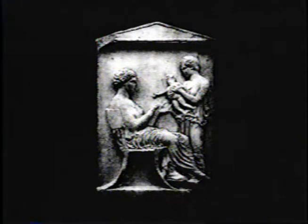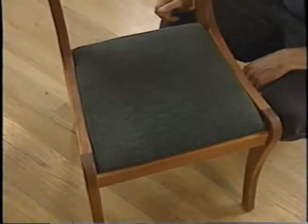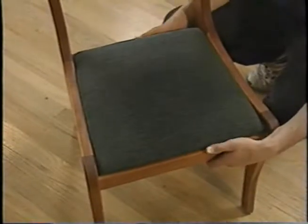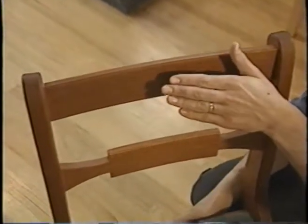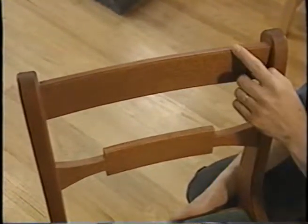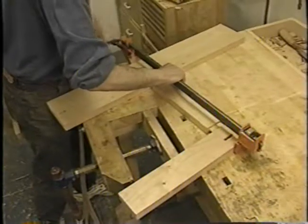But the idea goes back to the klismos chair in ancient Greece. You automatically get a trapezoidal seat by splaying the side frames. But now the angled tenons are on the front and rear rails, and there's a new technical problem to solve. Because these slats angle back inside the angled side frames, the top is shorter than the bottom, and the back is shorter than the front. This makes for compound angle tenons on these slats. But more about that later.